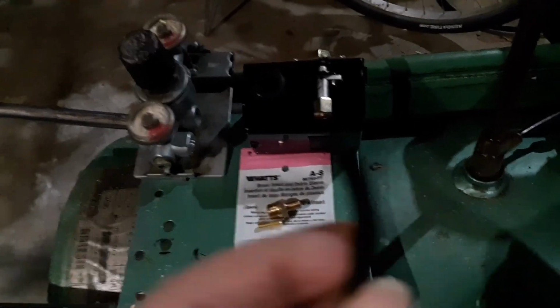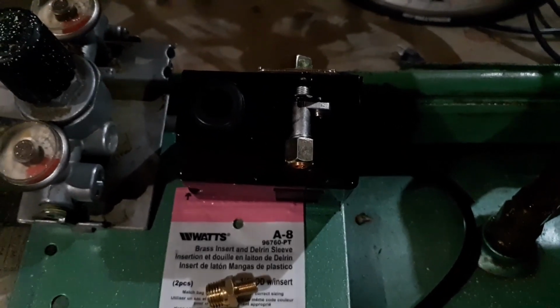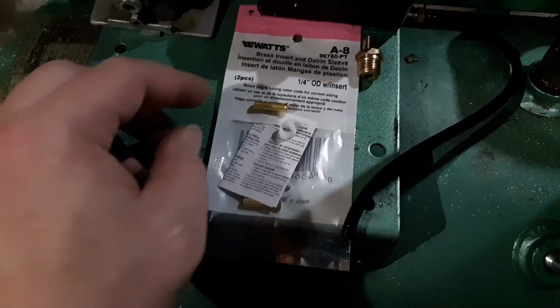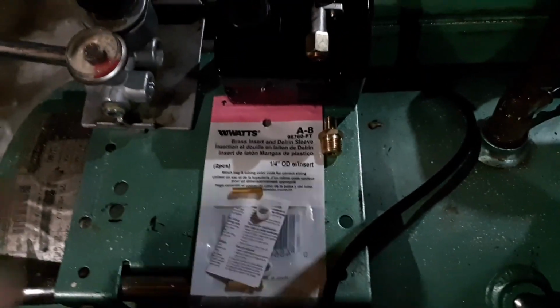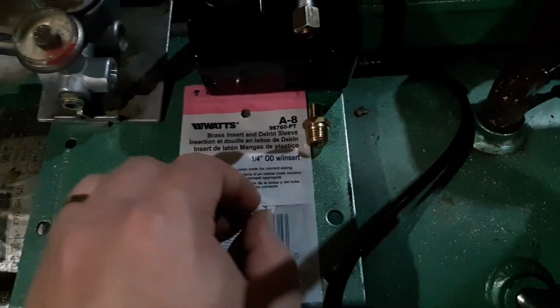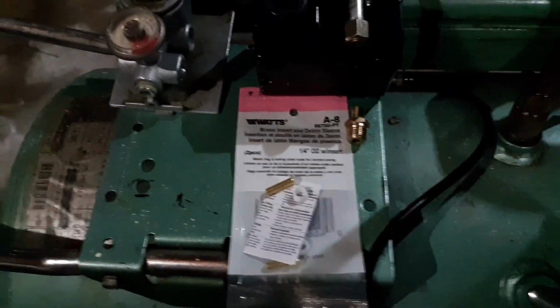One thing I forgot to mention was that this is soft tubing. Well, flexible. It's hard flexible nylon. That unloader valve connection is made for hard tubing, so I picked up this little kit here that lets me replace the little crush washer here with a plastic one, and this brass piece keeps the tubing itself from being crushed. So this threaded collar comes off and then goes onto the tube. The crush washer goes on like that, and then the brass tubing goes in and it all goes together.